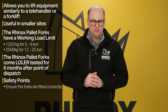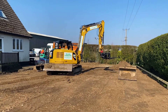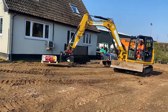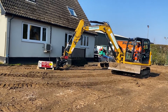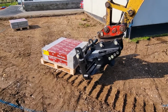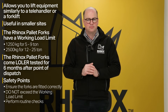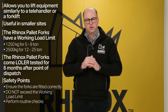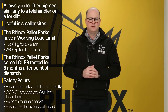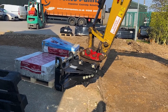Some key safety points when using pallet fork attachments on your excavator: ensure that the attachment is fitted correctly and is in full working order, as failure to do so could result in accidents. Don't exceed your working lifting loads — you really need to make sure you are fully aware of what your lifting capacities are for both the machine and the attachment. Carry out routine checks on your attachments and machine; anything that doesn't look right needs to be flagged for repairs, and make sure you have an up-to-date LOLER certificate. Make sure your load is secure, stable, and even — if you're not sure, get out and check or get somebody to check for you.